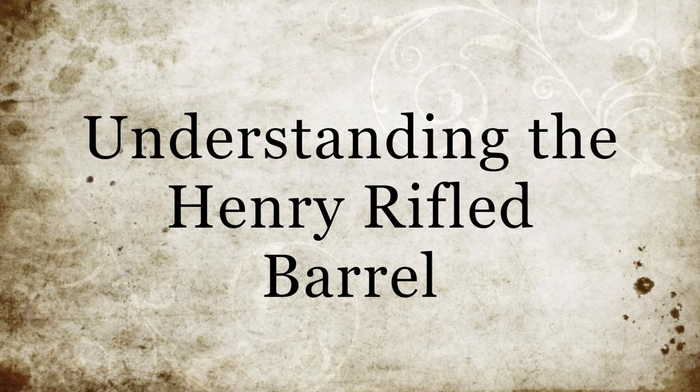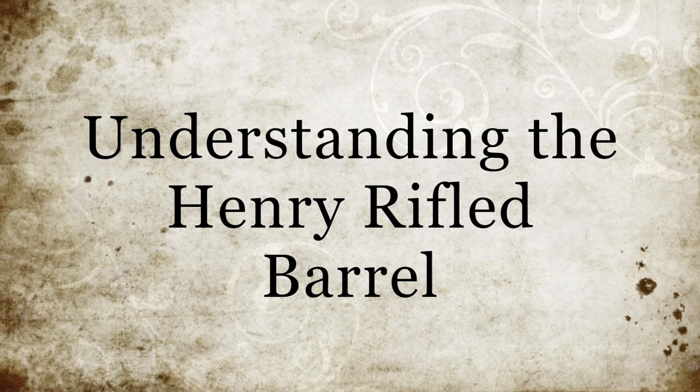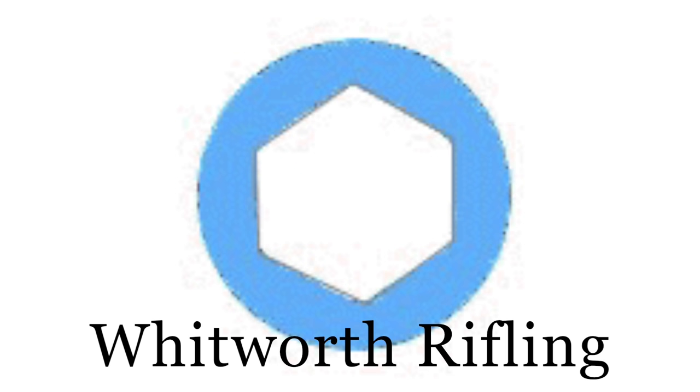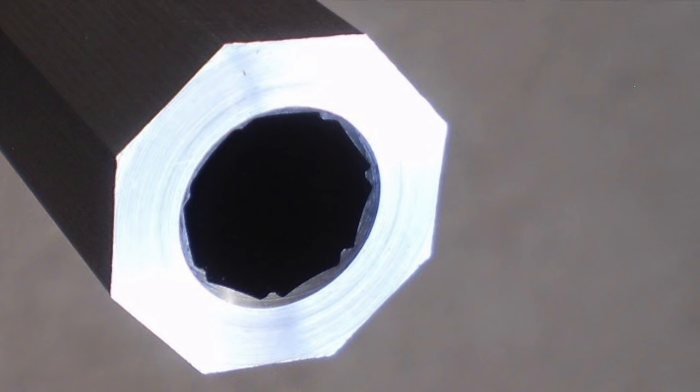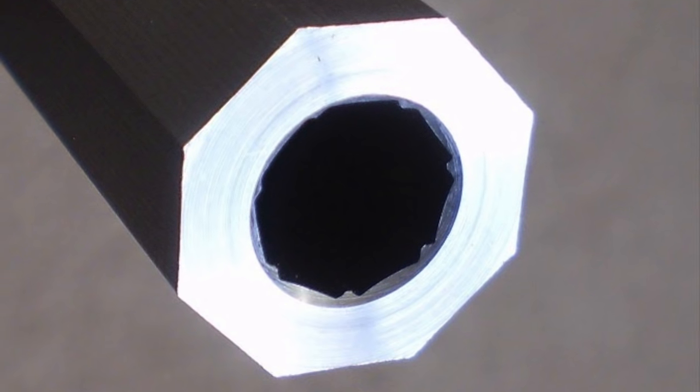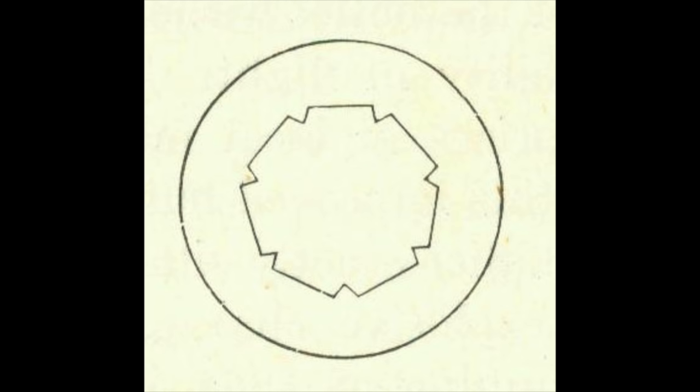The first step in doing this is understanding the barrel. The first aspect we'll touch on is Henry rifling. Invented in the 1860s, this form of rifling devised by the Scot Alexander Henry was a variation of the polygonal rifling invented by Joseph Whitworth. Henry's variation included seven sides versus six in the Whitworth, with the addition of a raised bead, nominally triangular in section, at the join of each flat. This gave exceptional bearing on the projectile, but the complex system also created many angles and crevices where fouling collected.